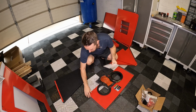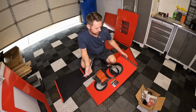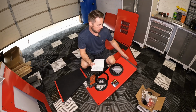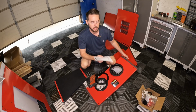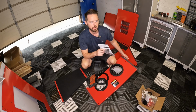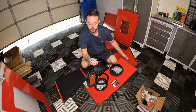This seems like it's a newer version because if you do look on a bunch of these, it actually has this gasket already pre-installed. And so previous versions, this stuff wasn't there. And so guys would actually go through and cover every single one of these edges in silicone because everything leaked. I did see that on these newer versions, it wasn't as necessary. It was pretty much get it together, get it up and running, go through, see if you have any leaks anywhere. And if you do, go through and do the silicone versus trying to silicone everything. So I'll have to see what the directions say about that silicone in this manual and see if they have any specific places where they're going to want to put it.